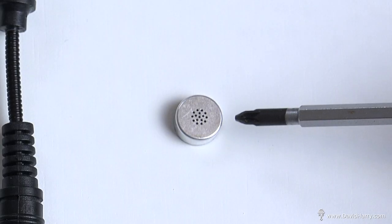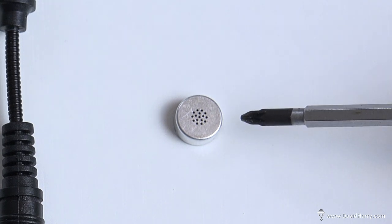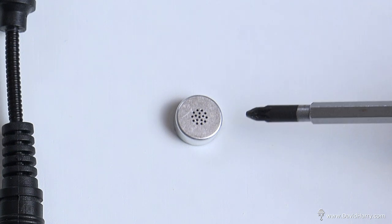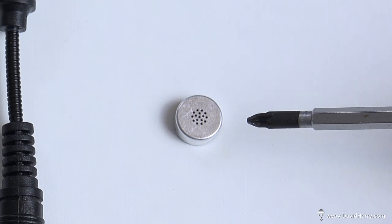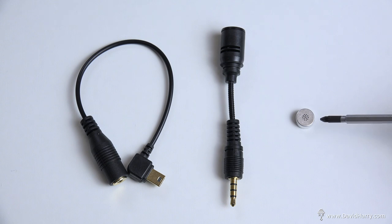And then also here, and this is the single most important part of the construction, is the ECM module itself, or the electret condenser microphone. This is a Primo EM172 omni-directional capsule. The reason it's an omni is because that's the type of microphone we're making. It can be bought from micbooster.com, and there will be links in the descriptions as to where to get this capsule from micbooster.